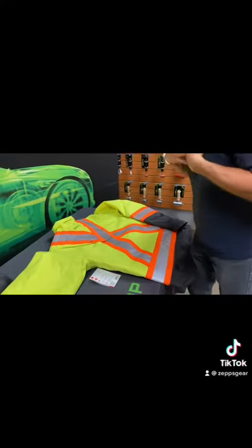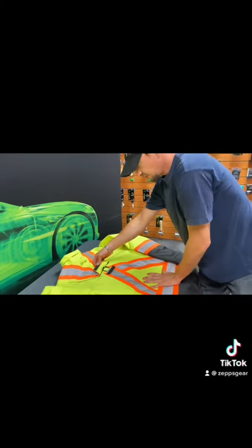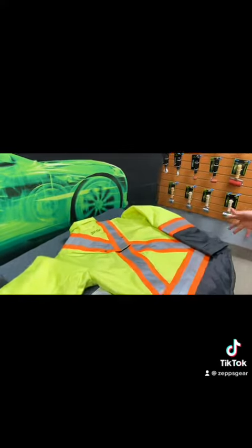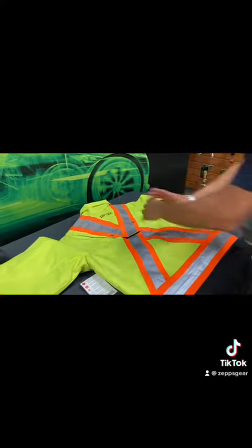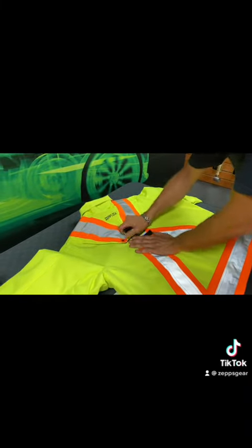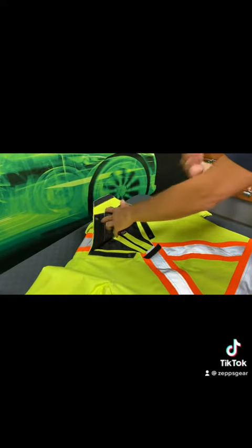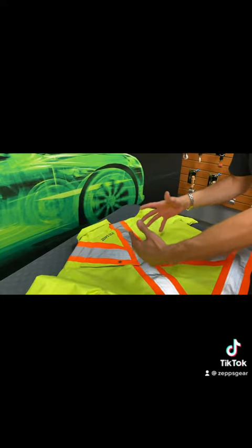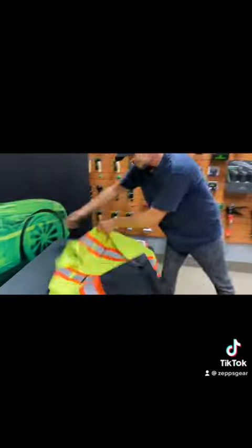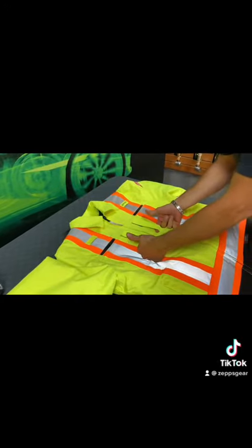You want to wear that harness tight to your body, inside the jacket. Now you can put your D-ring through and have your lanyard out, so you can wear your jacket comfortably. Your high viz is completely showing — you're not covering any of the high viz with your harness. It looks clean. If something did happen, the harness comes out and protects you; the jacket protects the harness.